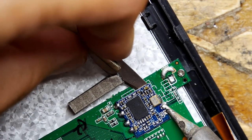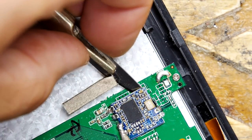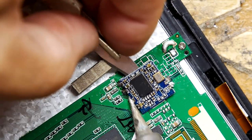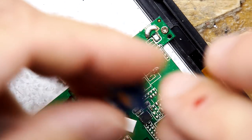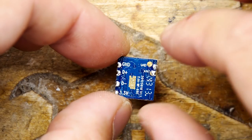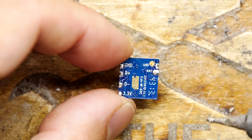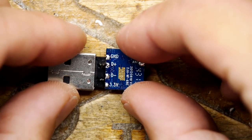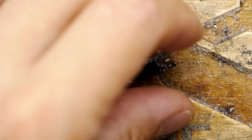Come on, get off the board. Now we're going to work the other side. We've only lost one single pad — that's not bad. It's a little bit bent — ow — but it's off. Look, it's USB! It's USB! It's got ground, D minus, D plus, antenna, and probably another ground. Wow, boys and girls — that means we can try wiring that up to something like a microcontroller. That's a video for a future day, but not today. We're already over our 10 minutes big time.